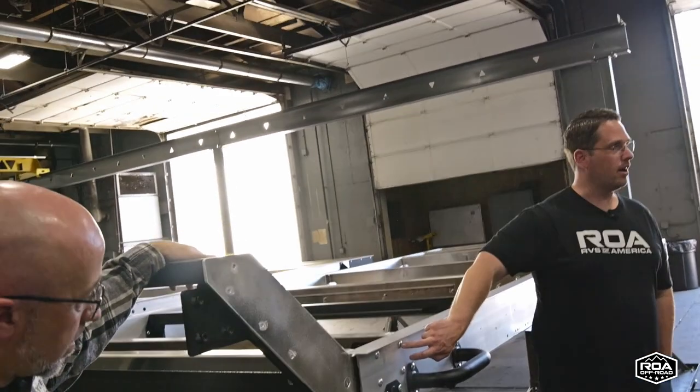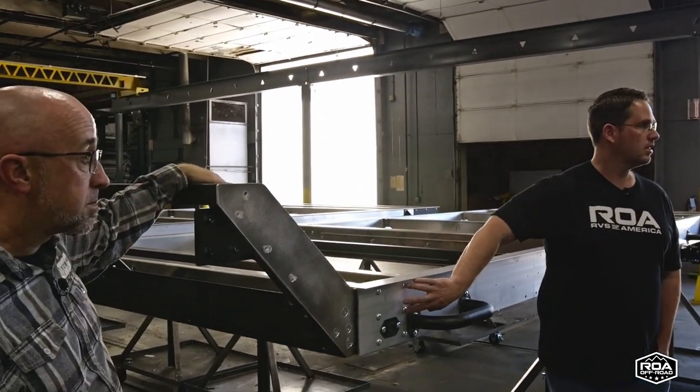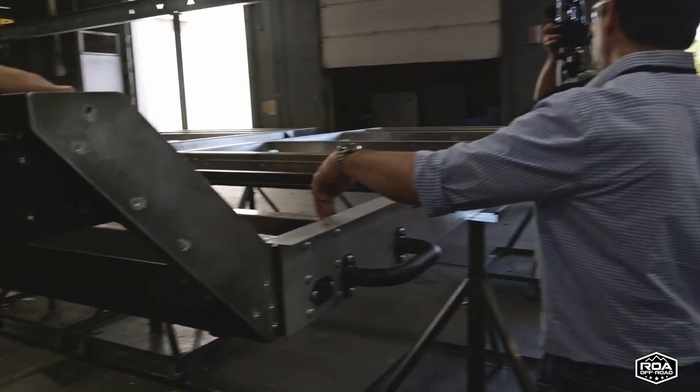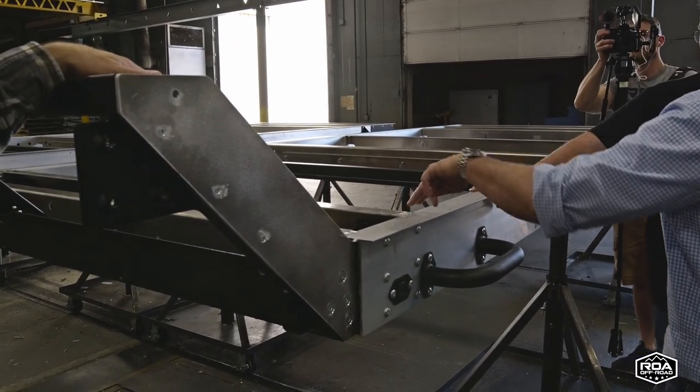What are these made out of? The Huck rivets are aluminum. There are a few of them that are steel. The ones we use that are steel are inside, outside of water and contamination. And we have done galvanic tests on the joints with the steel rivets, with no concern for structural stability whatsoever. We ran them through a 1,000-hour saltwater tub.